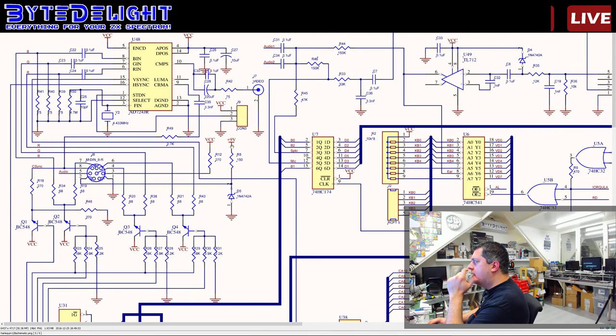Oh, here it is. 9 volts. Okay. I know what it is for. And it is quite interesting, by the way. This is the Zener diode creating the voltage level that is required for RGB blanking, which is on pin 2 here. So that's a voltage divider. Well, I should say it differently. So it's creating a voltage.